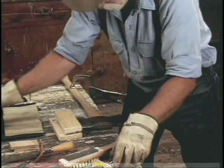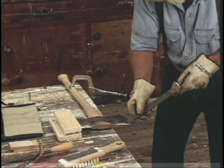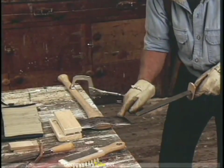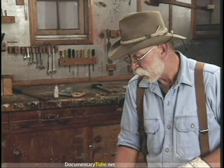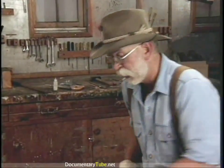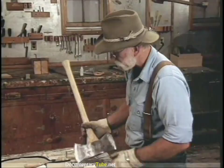It shouldn't be a straight edge — it should have a slight curve to it like that. The finished shape is going to be a half moon, with it filed more back into the cheek. Remember, I'm not just sharpening this — I'm rehabbing this axe and then sharpening it. If you take care of your axe, you can touch it up in 15 minutes with a file and the stones. But when you're starting over with one, it takes about an hour to do that.